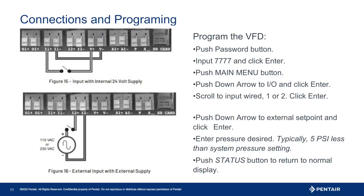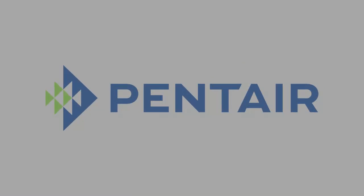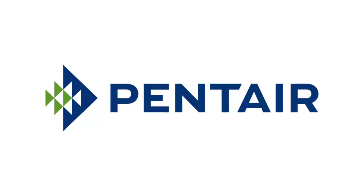Once satisfied the float triggers as needed, mount the float and if possible test the full function of the system. This may not be possible — for example, a cistern setup would be impractical to test fully. Explain to the owner the functions and ask that they monitor the system and call should there be any issues. Congratulations, you have programmed and installed the float switch accessory. For more information, please refer to the owner's manual. Thank you and see you next tech tip.